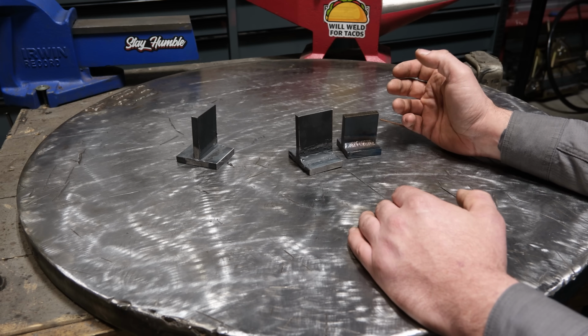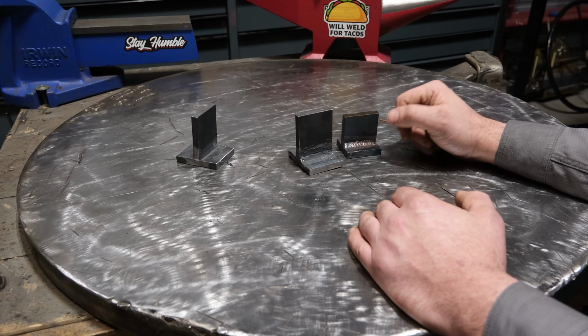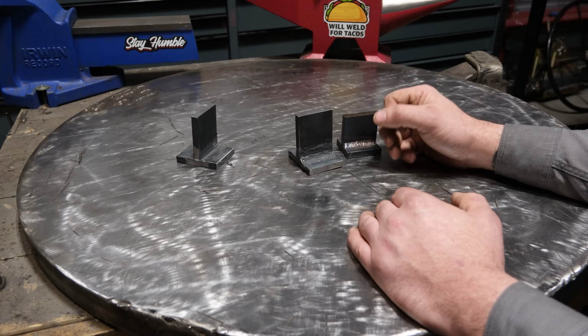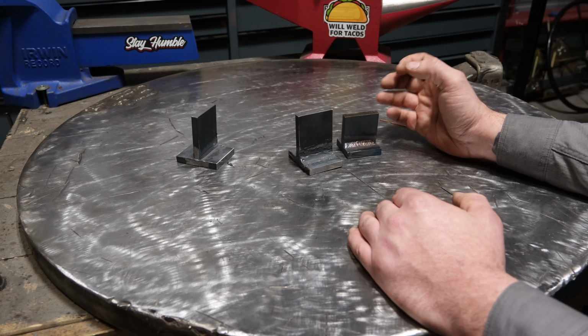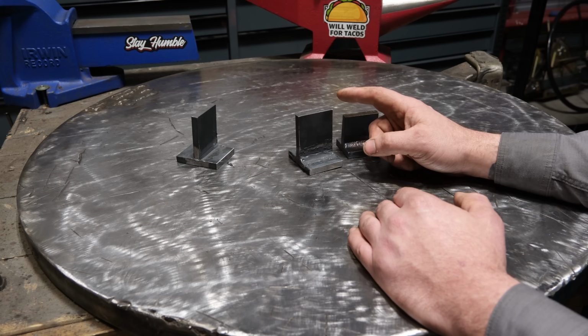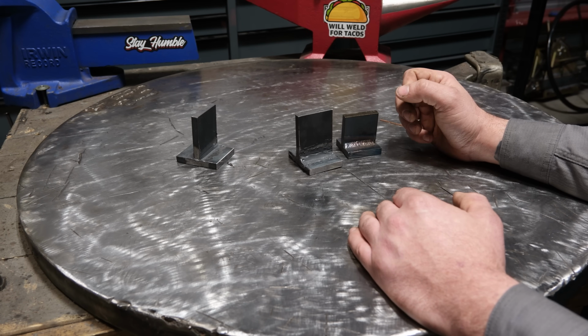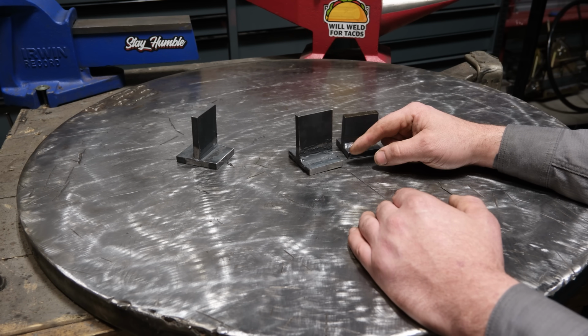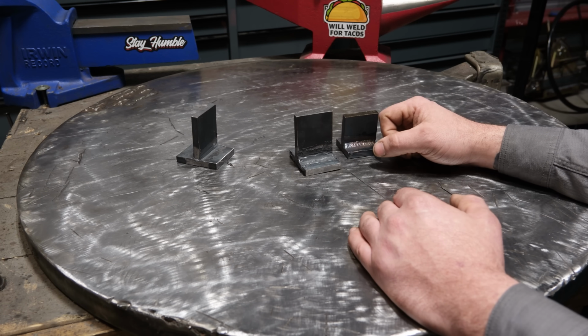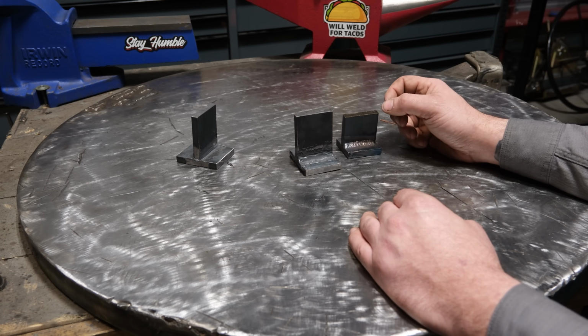But more or less, if you ever do brazing, brazing functions more like JB Weld, where it's a cohesion process. The difference, though, is that brazing, I have a feeling, is far, far stronger than JB Weld. And maybe in the future, at some point, I'll do an actual bend test with brazing with TIG, with silicon bronze, just to see how strong that actually is.